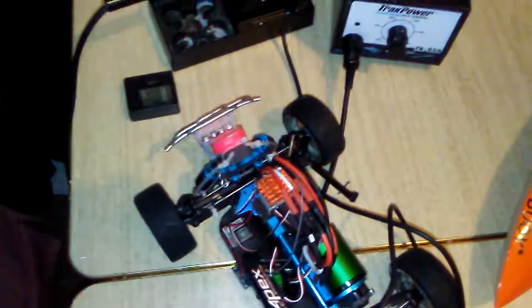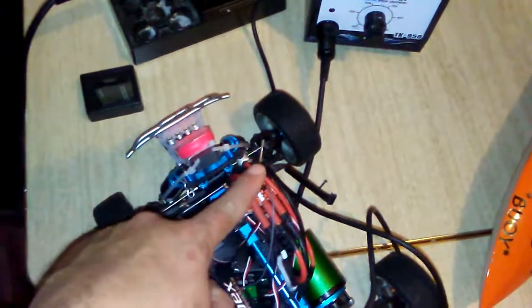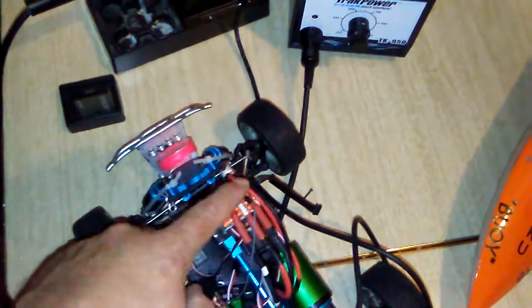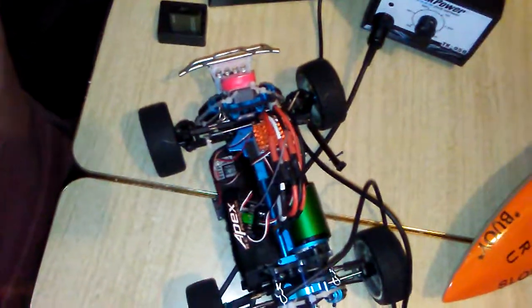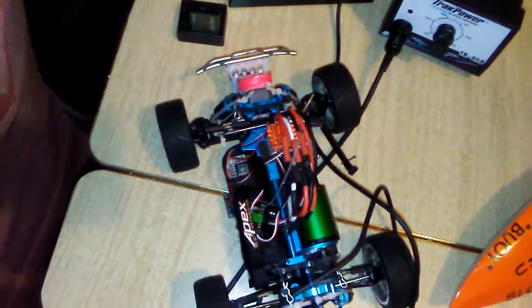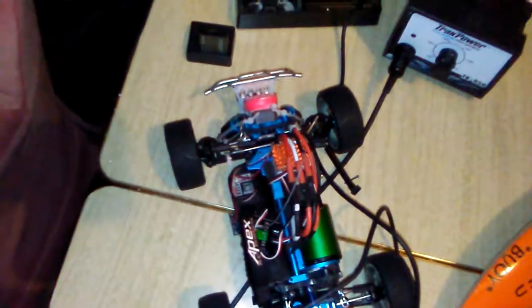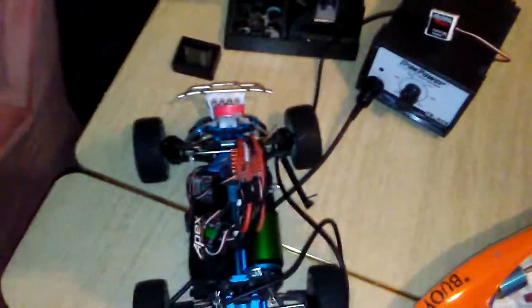Basically, you just have a positive and negative wire. You just hook it up to your positive and negative post. I may have to resolder a little bit, run 2 wires, and figure out where I'm going to mount this cap pack. But I'll get that figured out, and hopefully that will resolve the heat issues. Because like I said, guys, it got really hot, and I do not want to tear this up. But it was also 96 degrees out, and I'm sure that didn't help. Anyways, that's where I stand, and I'm going to get a run with the boat hopefully tomorrow.